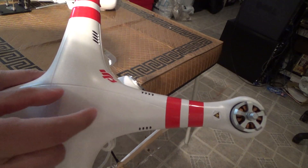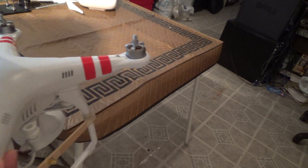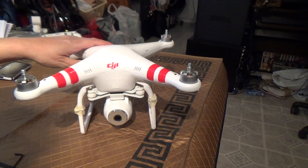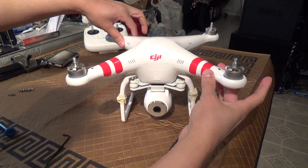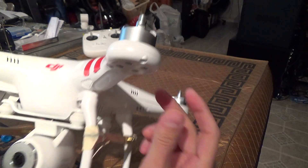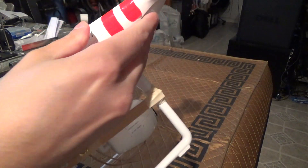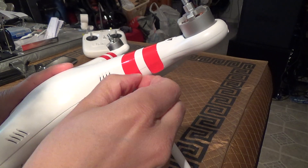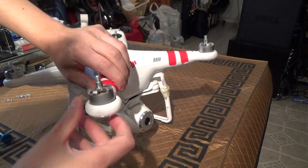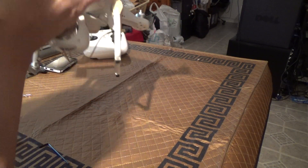You want to be careful pulling it out because it's connected with a wire to the GPS — the antenna is in here. When I come back the top will be off. Now I'm taking the screws out of the bottom that I need to lift the cover off. I have not touched the screws that actually hold the motors in, because I'm going to leave the motors in place until I've undone the soldering to the wires for each motor. Since I have stickers on here, to lift the top off I have to peel out the sticker. I choose not to cut them.